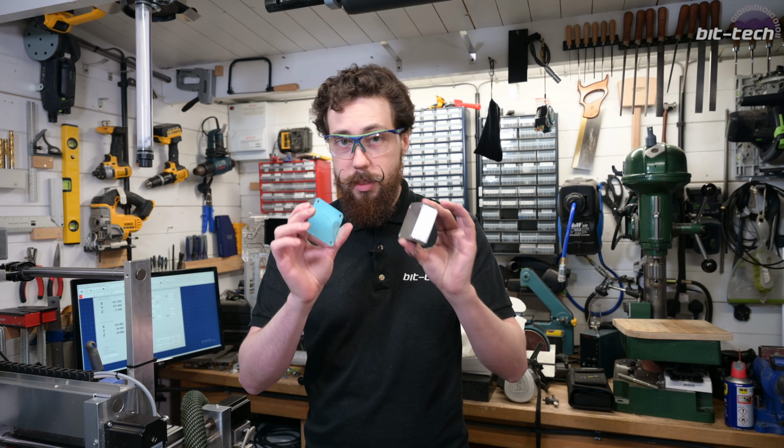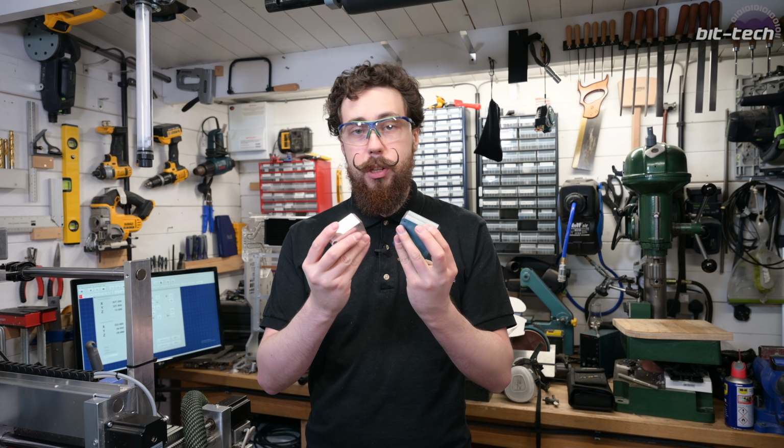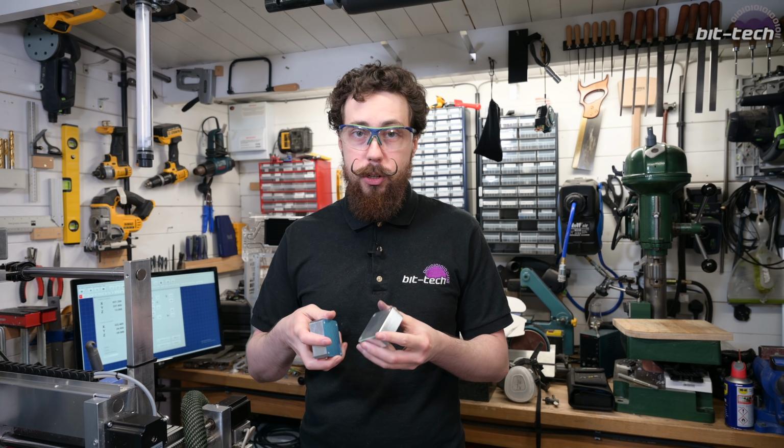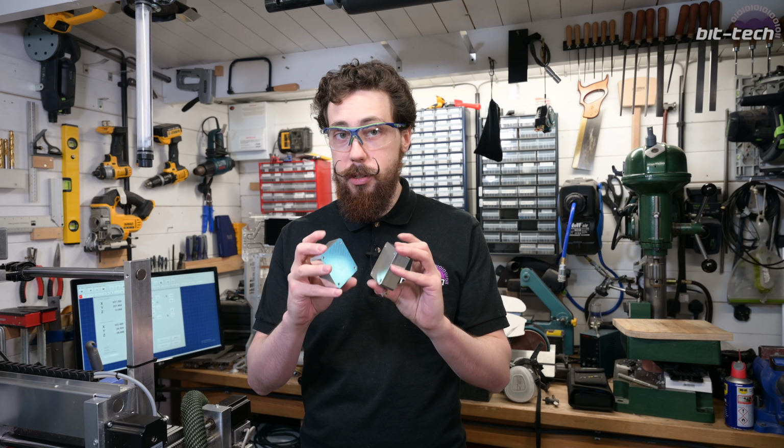So what's special about these is that they're dimensionally correct on the outside. This is about the best finish that I can possibly hope to achieve on this machine. It's just not rigid enough to do deeper cuts and avoid witness lines, unfortunately. But because we're going to be glass blasting it, it shouldn't really matter at all. And they're actually quite nice and smooth.